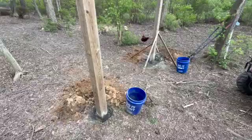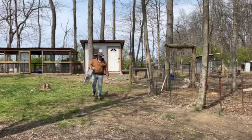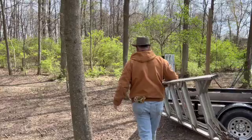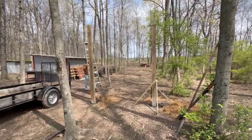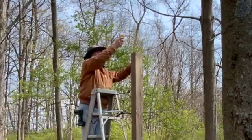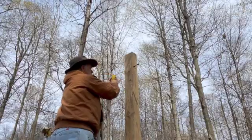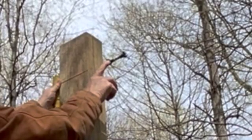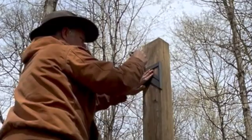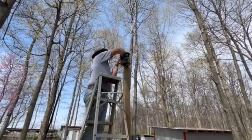As I mentioned earlier, I knew the post on the right-hand side was going to be a little bit taller than the other one, so before adding my girder beam I had to cut that higher side down. To do this, I put a screw on the outside of the shorter post, then ran a line from that screw across the top over to the other post and scored a little line. Then I used my line level to make sure it was level, marked the lines, and made the cut.